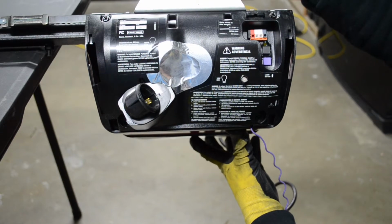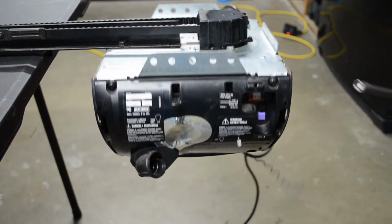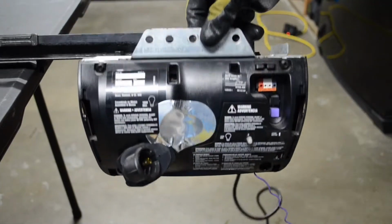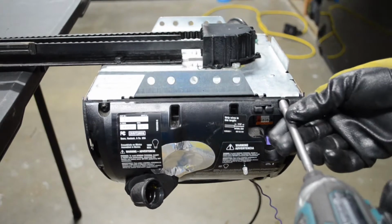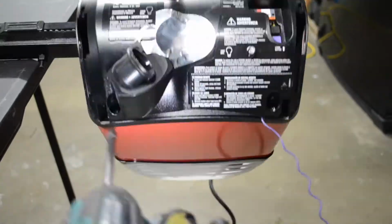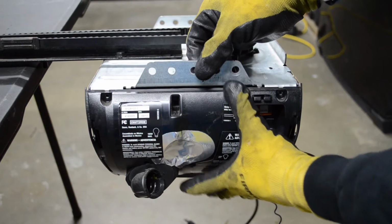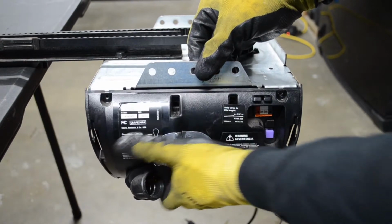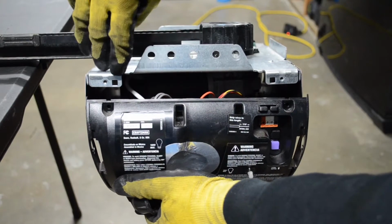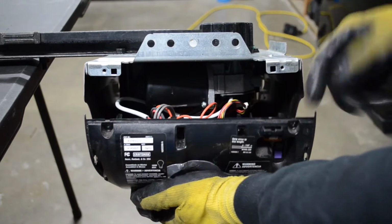Like I said, you could strictly use a screwdriver, but for the sake of time, I'm going to use my impact gun. I'm going to start by unscrewing 1, 2, 3, and 4 bolts, or little tiny screws there, to release the whole panel. So there's my 4 screws. They are released. At that point, this whole panel pulls outward. See how you got these 2 little square openings? That panel has parts that go into that, so you got to pull it out.